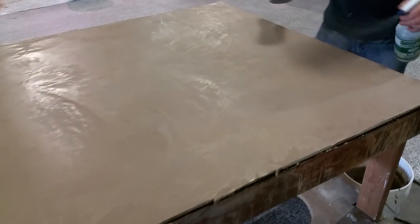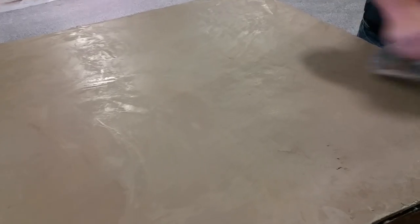If you zoom in you'll see that we have really good movement throughout the piece. But we can burn the piece as well with this steel trowel. Watch what happens when I keep going over the same area — see how it's getting darker and darker?